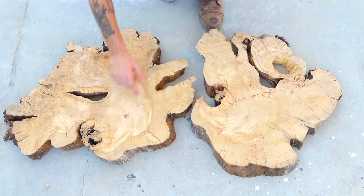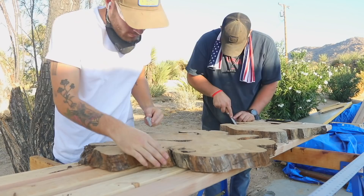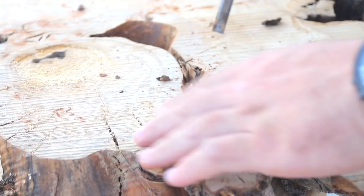For the tabletop, I'll be using two olive wood slabs. I love these because they've got a ton of voids that are going to interact with the epoxy really well. To prepare them for epoxy, I removed all of the bark on the outside as well as in the voids of the slabs. Make sure and remove any loose pieces, that way it doesn't float in your epoxy once it's poured.